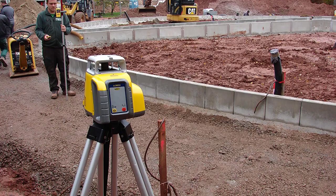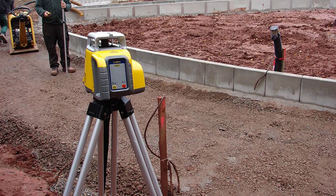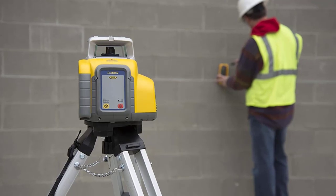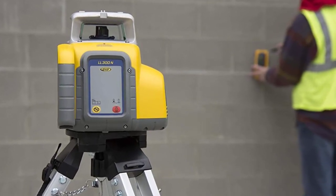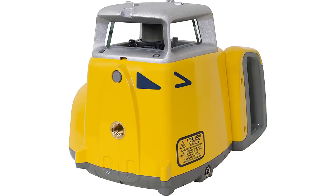Complete leveling crew in one portable hard-shelled carrying case — tripod not included. Rugged design with hard hat rotary protection provides superior drop and outdoor weather protection, IP66. Ideal for all general concrete and construction site preparation applications. The optional RC-601 Remote Control gives you the ability to put the laser level in manual mode for matching slope applications.